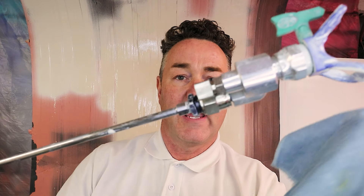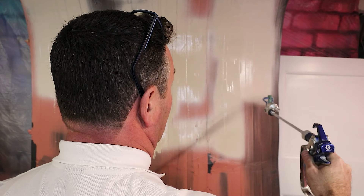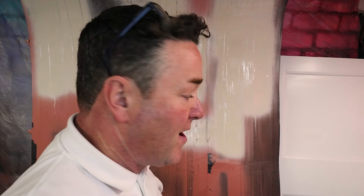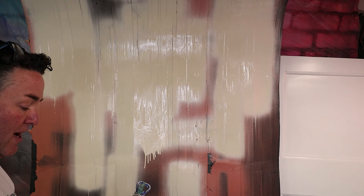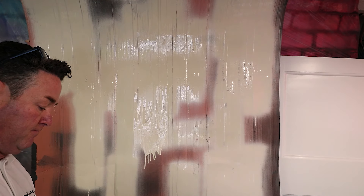I'm going to stand just off camera. I've got the board there and you'll see. I'm going to hold it in one spot. Can you see that bit of a tail coming there? That is the spits. You've got a spit - let's do it again. So this is a nice amount of paint going on, but it is giving me a little bit of a spit. I'm going to swap now to the Graco clean shot. I'm going to turn the machine off and release the pressure because I'm taking off that tip guard and putting the clean shot on the end to show you the difference.